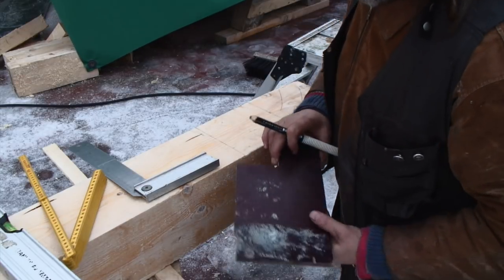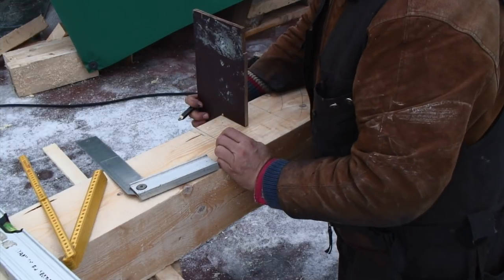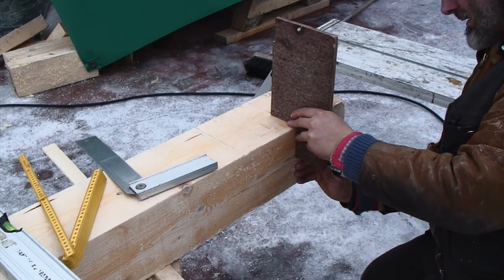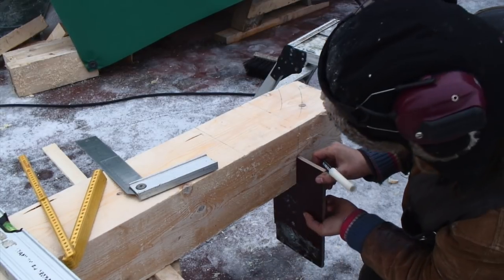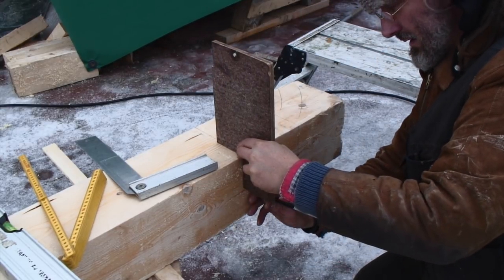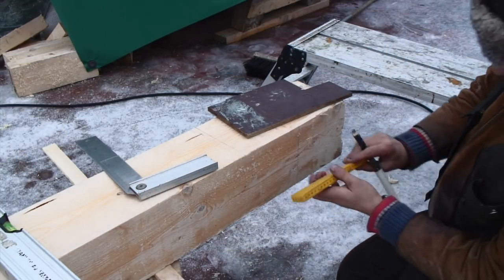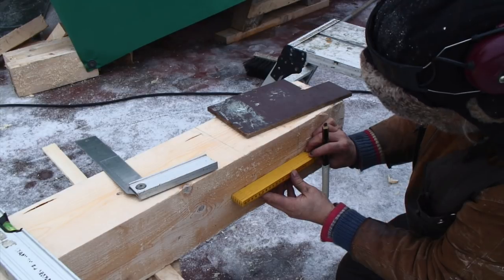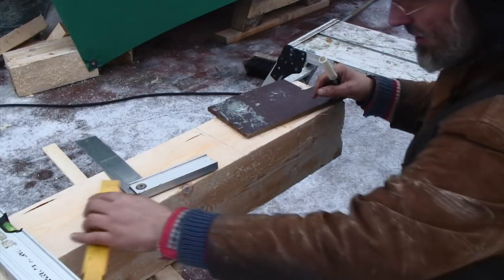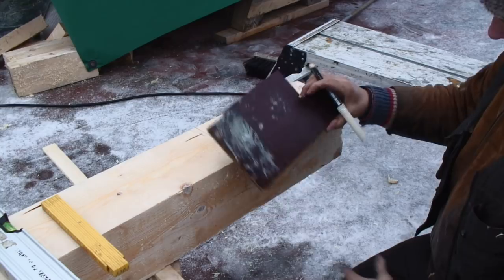This is 7.75, this thing here, which is half of the width of the material. It's something I learnt from Jon Borgudal, who is a bit of a guru in Norway when it comes to timber, things to do with old building techniques. It's a kind of key.